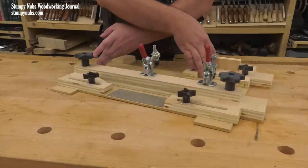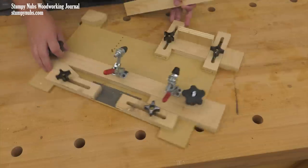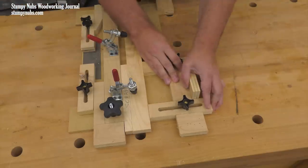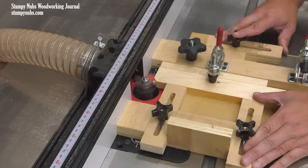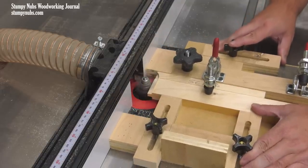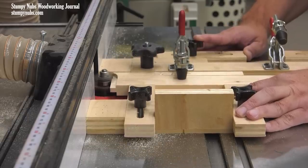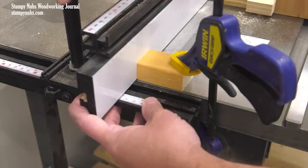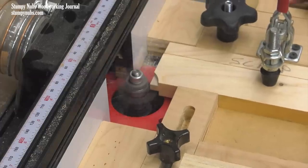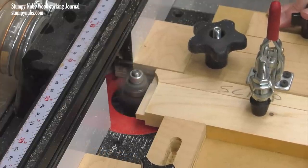Small parts holding is only one of its functions. If you rotate the clamping bar 180 degrees it becomes a coping sled for cutting tenons and making cabinet doors. Most coping sleds require a router table with a miter track. This one works with the fence alone, giving it a unique advantage. With the addition of a small stop block you can make your cuts in two passes — one to remove the bulk of the waste and a second lighter pass to achieve a really crisp profile. The combination of toggle clamps and lateral supports virtually eliminates any workpiece shift which might compromise the accuracy of your cut.